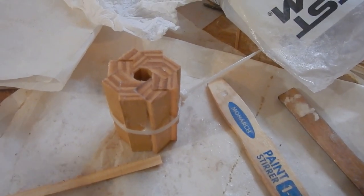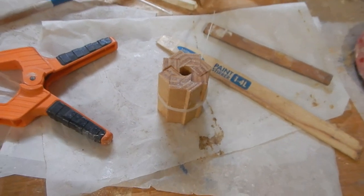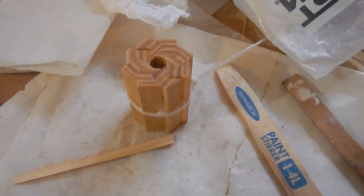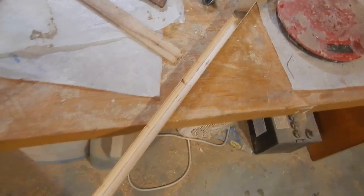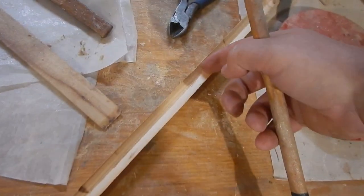I did a bit of an experiment on how to most optimally put the epoxy glue in the grooves. I tested a few different ways of putting the goo in there, and what I came up with was: if you just fill this groove and then smear it down so that really there's only a bit in the bottom third of the groove, that's enough — when you compress the staves together it will squeeze out and fill all the gaps. It should enable me to do this a lot quicker than when we glued up the mast, which took two or three hours.